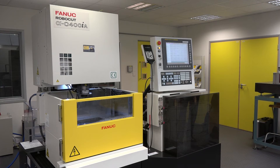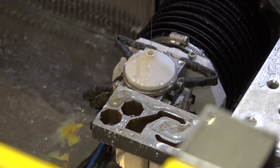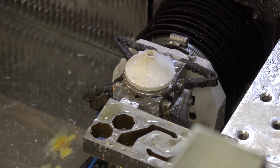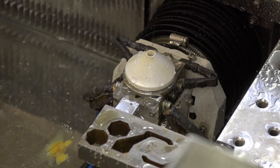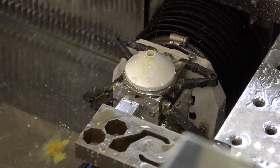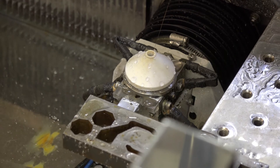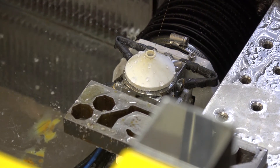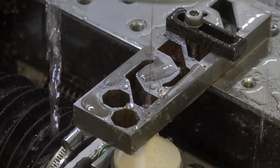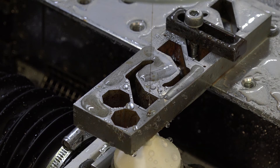When I look at the characteristics and the size of the machine, the C400 has an X and Y travelling distance of 370 by 270 millimetres. It's got a UV-axis travelling distance of plus or minus 60 millimetres, and a Z of 255 millimetres. The max workpiece size is 700 by 555 by 255 in height, and you can take the weight of a component up to 500 kilograms. The wire diameter on this machine ranges from 0.1 to 0.3, the adjustable wire speed is 1 to 15 metres a minute, and you can house wire spools up to 16 kilograms.